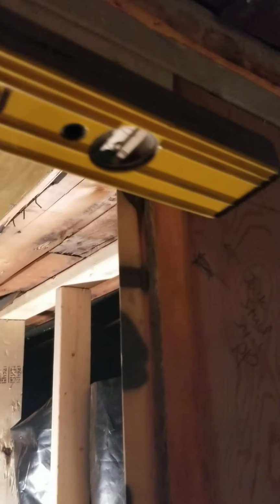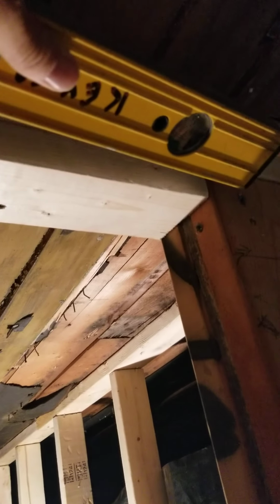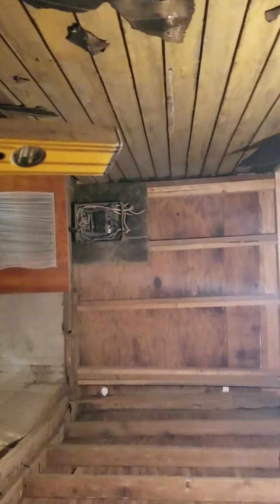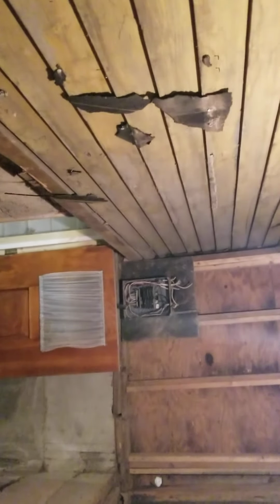We're going to move our jack stud over here where this mark is, and then we'll run our king stud up. So we'll unscrew the jack stud, move it over, cut it. We can unscrew from the king stud and then move the king stud over. Our pipe will be able to fit right between the king stud and this existing stud. We're going to rip that old electric panel off the wall. We'll probably have to double elbow it out, and that's where our dryer exhaust is going to go. So that's probably about 14 feet.